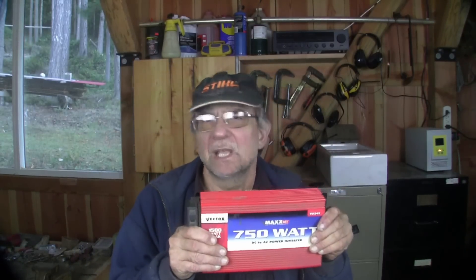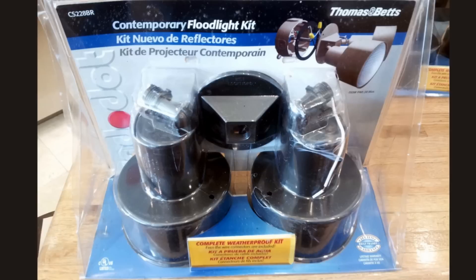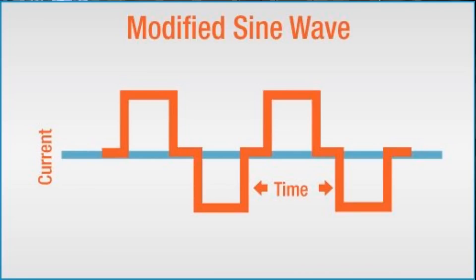As a test I decided to hook up my old cheapy inverter and take a look at running modern household LED bulbs on 110 volts. I found a good deal on some heavy-duty double light fixtures and hooked one up, complete with the bulbs, to the inverter. Jane and Bea came along and asked if I intended to operate a strobe light. The bulbs and their electronics didn't seem to like the power supplied by the inverter, possibly because of the chunky modified sine wave it produces. I figured I needed a better quality inverter, one that produces a pure sine wave at 110 volts.